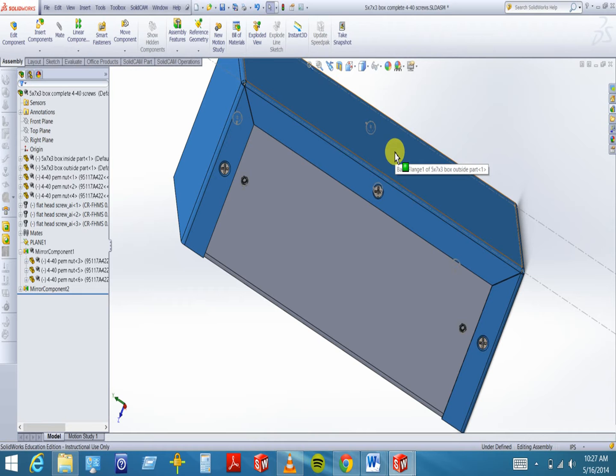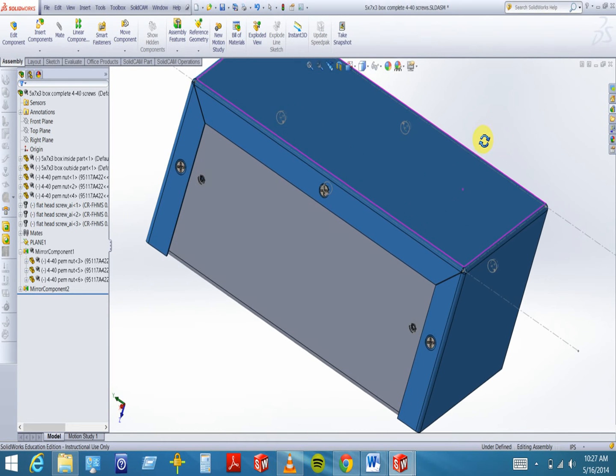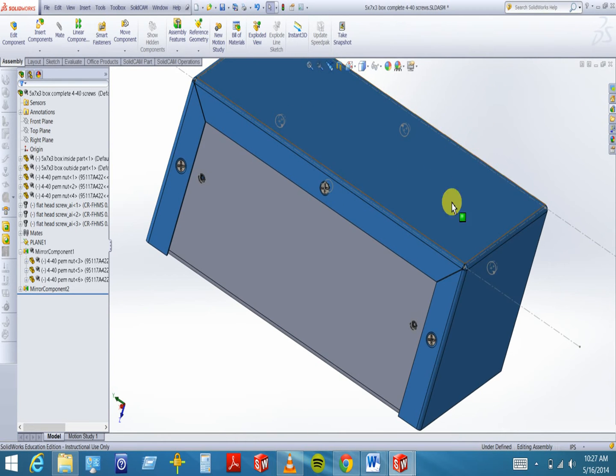Sometimes you want that, sometimes you don't. An example of when you don't is if you have a system that you're designing and you're going to use a servo motor, let's say, that you're buying from a company. You are never going to change that servo motor. You can't just change a dimension on a servo motor that you bought from a company. So you probably want to fix that servo motor as a design model, and your parts would not adapt to that servo motor, or the servo motor would not adapt to your parts. So there are times you don't want adaptive parts. You want to fix the part.